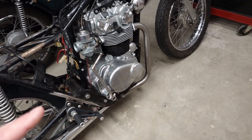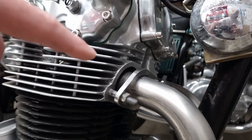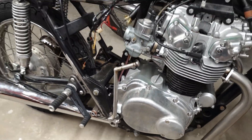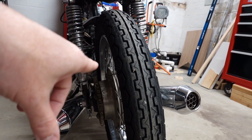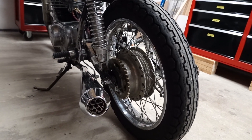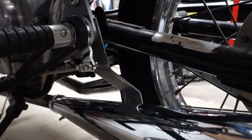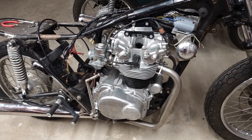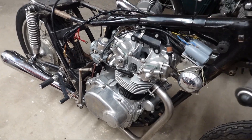I've got quite a bit more welding to do — everything's just kind of tacked together for now. I've got to weld around the butt joint on each side and then weld the bracket and the collar on the inside, but I'll do that at a later date. The one semi-unknown is chain clearance for the bracket — sighting down the rear sprocket and the drive sprocket up front I'm not seeing any interference points, but until I've got a chain on there I won't know for 100%. I think on the left-hand side clearance should be more than enough. Other than that, we're ready to jump back over to the electrical. Once the electrical is done we should be able to hook the auxiliary bottle up and see if we can get this thing to fire up. As always, thanks for watching and I'll see you in the next video.